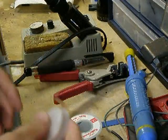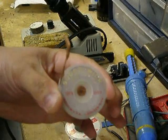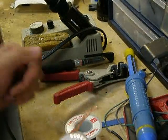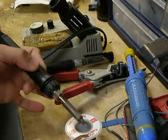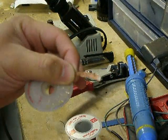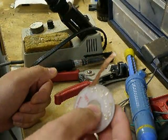The other thing that some people use if you're doing a lot of circuit board work is solder wick. Solder wick basically looks like a braided copper. The purpose of using this is when you put it over the circuit board along with the soldering iron, the wick will absorb all the solder off the circuit board. That's why they call it a solder wick — it wicks off the solder.